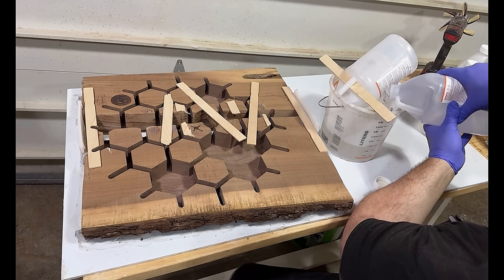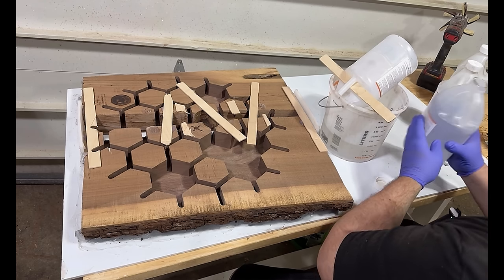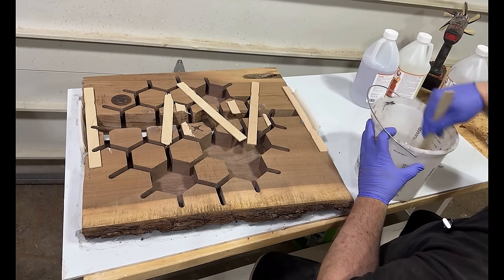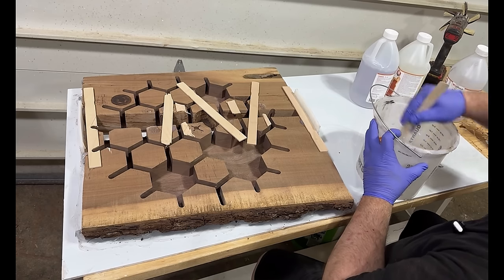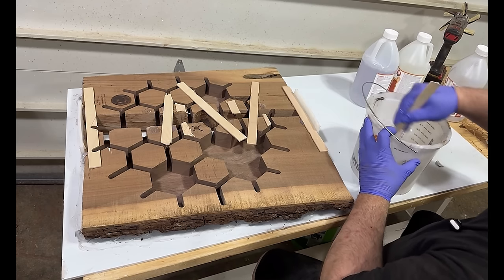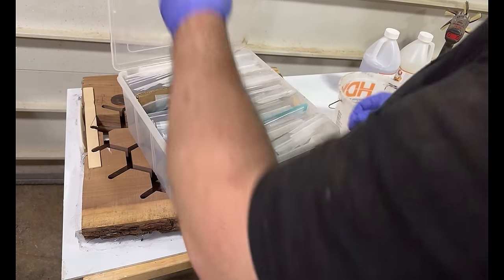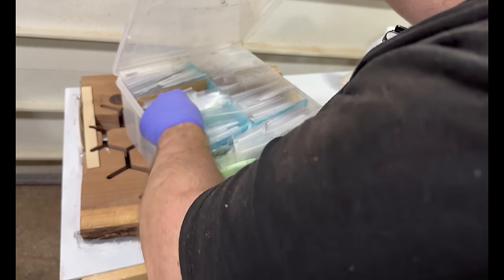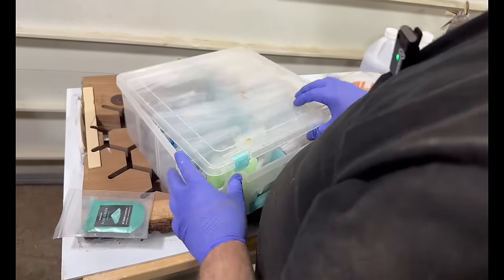I would say it glues the wood down to the polyethylene, but that's not really accurate. It basically just makes it a big bowl, so it starts pushing down. If I didn't do this part, I would have to make some cauls that stretched across the wood to push it down because the wood would float in the deep pour epoxy. I came up with this method of mold making because I'm lazy and I wanted to do less work, and this process is much less work.